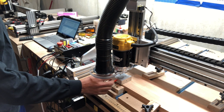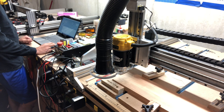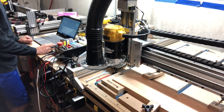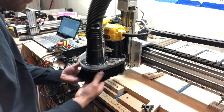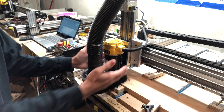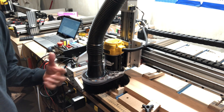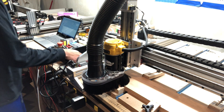Alright, we are back. We are about to carve a small little plaque - we just zeroed the material, everything is ready to go. We're going to raise up the Z-axis and we are going to place the bottom part of the dust boot, which is the magnetic part. We're going to lower it back to zero. When you do this dust collection, I have mine all the way up now. If you have a longer bit you want to adjust this accordingly, but you want the brushes over the material. It would be better if it was a little bit higher, but I'm using a short V-bit so I'm okay with this. We're going to make sure it's tightened, it's not moving, and we're going to begin our carve.